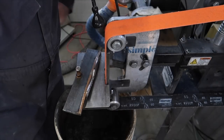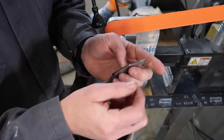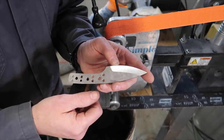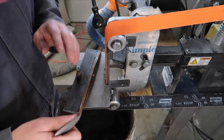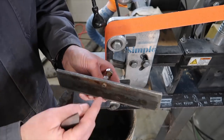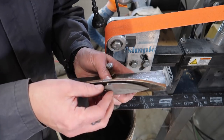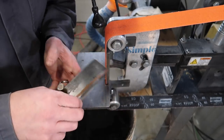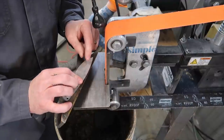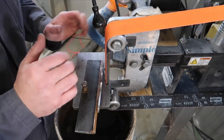One thing I noticed — the jig I was previously using wasn't giving me the right grind. We were pretty much to the line about halfway through the cutting edge with that 10 to 15 thou clearance, but I'm not getting enough grind on this side of the blade. I like the bevel to come up higher. So I'm switching to this jig — just an angle iron with a bolt and a little locating pin I slip into one of the holes. That way I can get a little higher bevel. I like the bevel to come up at least halfway. Got to be flexible sometimes.